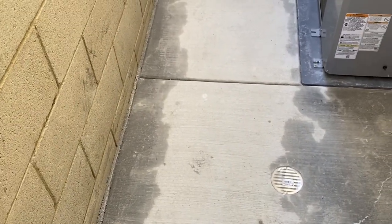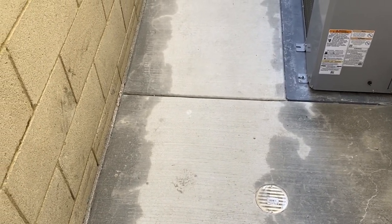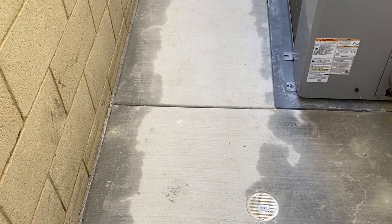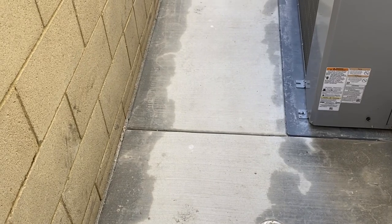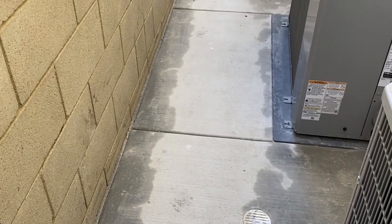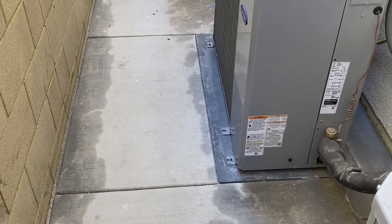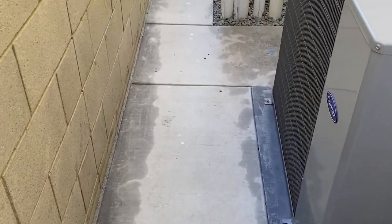This is actually quite a common thing that happens on concrete, and I get callbacks — a lot of texts from homeowners worrying about this. But this is just concrete drying because it's in a shady area. Typically within a couple weeks or months, depending on how hot it gets, this goes away. I get a lot of concerned clients saying their concrete is damaged, but this is actually just a natural occurrence — it's still drying.